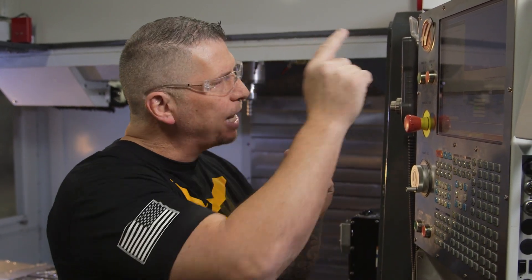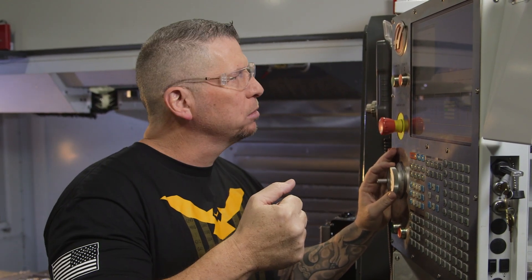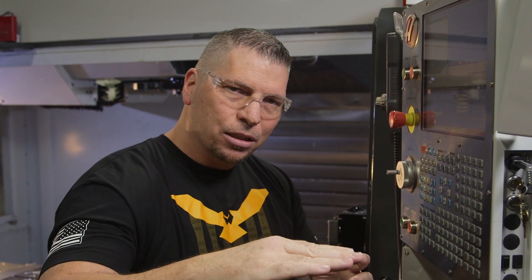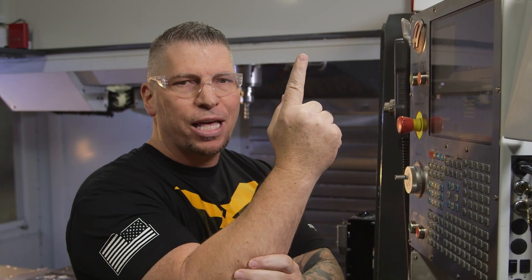So I just wanted an opportunity to clearly explain this to you. When looking at the code I created in vlog number 51, I'm not going to worry about the meat up top — I'm just going to worry about the ending down here. So what I did was I raised to G0, Z.1, and then I used a G28 to go home. I actually used a probe to touch off my tools, so instead of having a Z negative, I have a Z positive. So instead of doing a G49 and canceling it — which would send it down — I instead use the G28 and the G91 to force that move up.